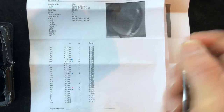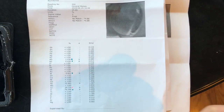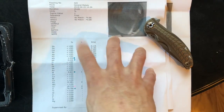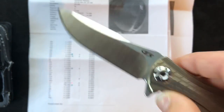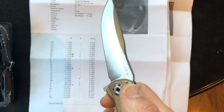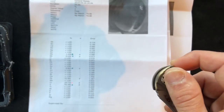As far as the HRC on the ZT 0609 — this came up at 58.4. As you guys well know, 20CV is supposed to be in that 59 to 61 range, and it should really be in the 60 to 64 range to really see what 20CV is capable of. When you get it up into that high range is when you'll see the big difference between 20CV and something like S30V, S35VN, or LMAX. Seeing it at 58.4 is not stellar — I'm not super stoked on seeing that.